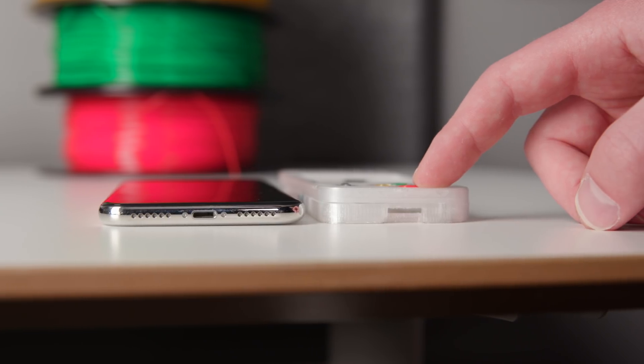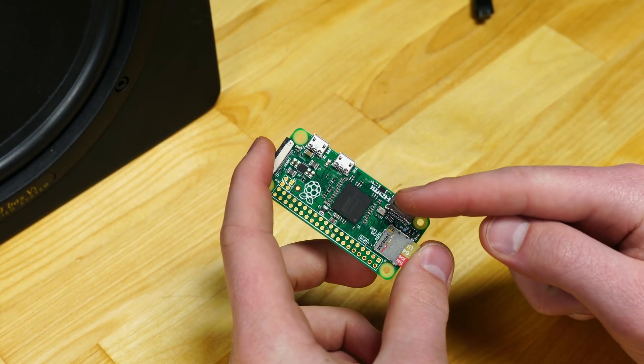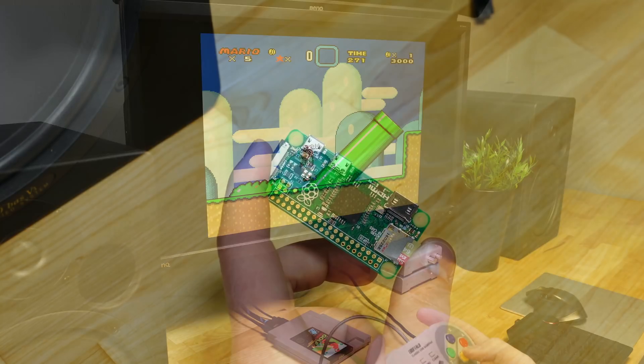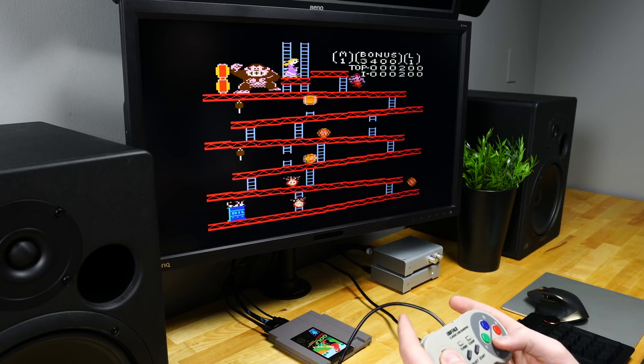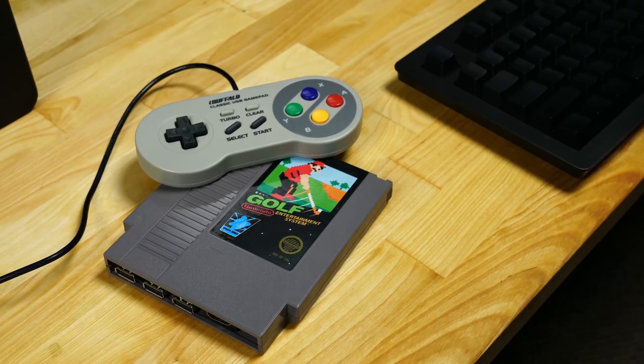This build is not without its faults. Number one, it's a little bit pricier than building your own design from scratch. Number two, and this one's a pretty big downside, there's no onboard audio — it's kind of a bummer. You can add this yourself later on, but it's just not part of the build. Number three, it runs on the Raspberry Pi Zero rather than the more powerful and larger Raspberry Pi 3, done to cut down on cost and size. This little guy will emulate NES, Game Boy Color, Game Boy Advance, and Sega Master System games without a hitch. SNES titles will also run pretty well, but they're slightly slower than native. Everything after that — forget about it.